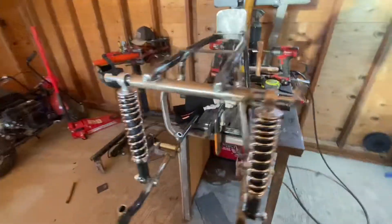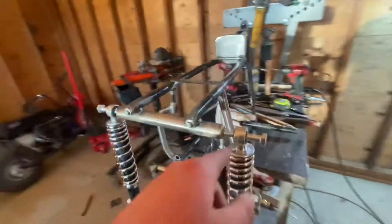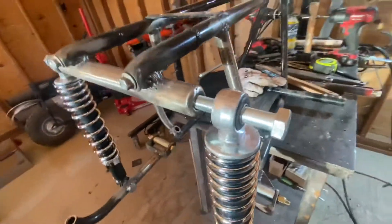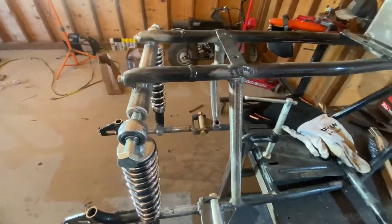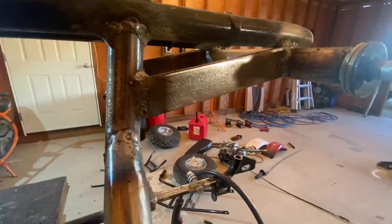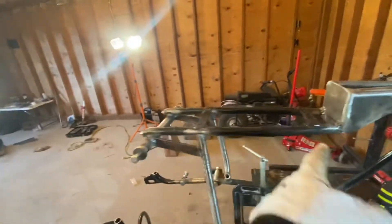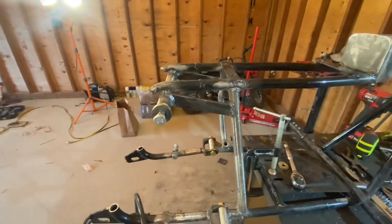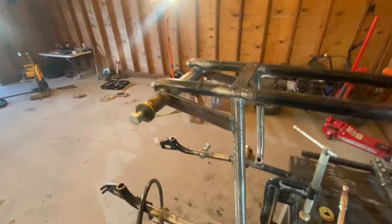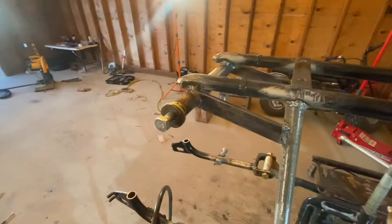I have a loose mock-up of how the shocks sit - everything is welded in place but these aren't fully secured. I welded this shaft across, welded the nuts on the inside of this bar so it has a really solid support system. I'm going to add some gussets from here over to these vertical bars for a little more strength. Got these little gusset braces out of quarter inch steel to help with deflection from the shocks. Even these brackets alone would probably be strong enough, and with the top tube adding triangulation - it isn't the best triangle shape but since this is one inch by quarter inch flat bar it adds quite a bit of leverage.